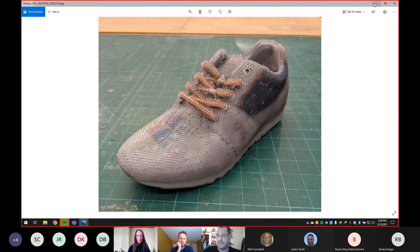Tom mentions one big disaster: a leak where the purged waste area failed to correctly report how full it was, so it kept filling and overflowed. Any printer using sticky resin goo has the potential to end up with it on your floor, keyboard, and pants — that's been Tom's experience. Adam acknowledges it: there's a specific calibration procedure for the waste container that requires close attention when setting up the printer to avoid exactly this kind of overflow.